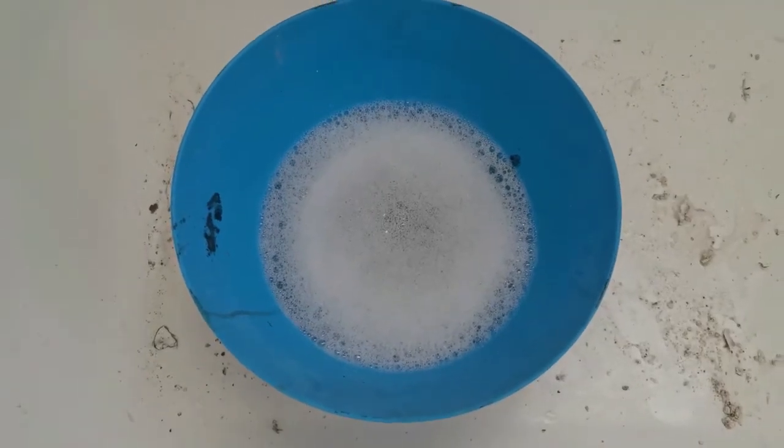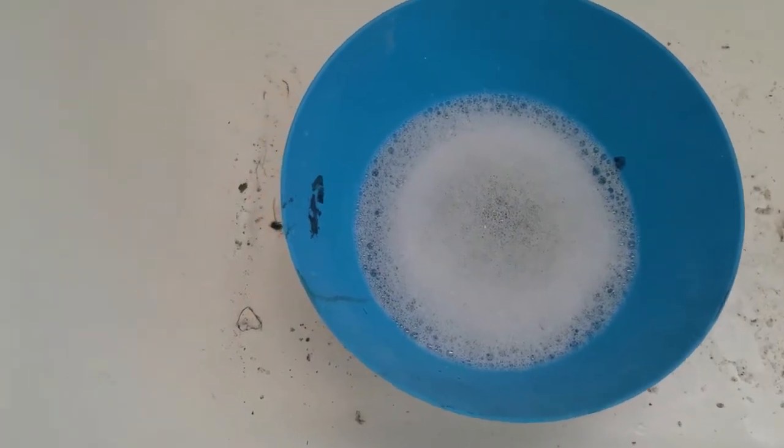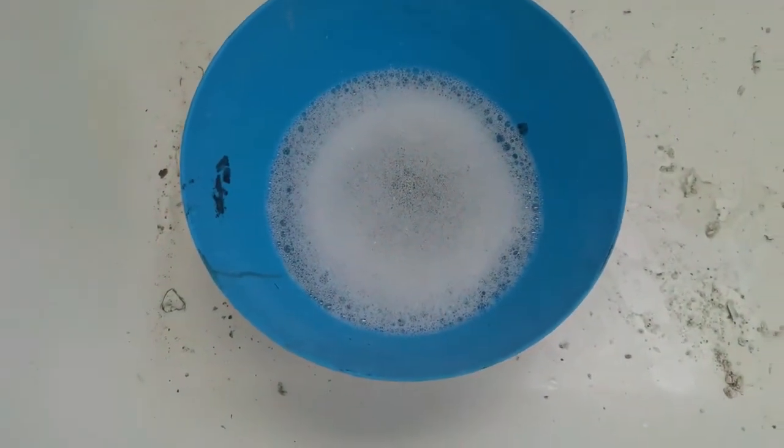I've taken out all the old silicone — most of it. I'm going to wash this whole place clean now. The bathtub is loose here and definitely loose on the side as well, so this thing is not even properly cemented in. The next step — I've got some sugar soap here. Please remember to wear gloves because this stuff is corrosive, it does eat you a bit. Then I'm going to attempt to see how clean I can get this groove. Hopefully quite clean — I'm going to use this brush as well as this sponge.